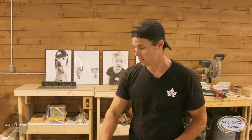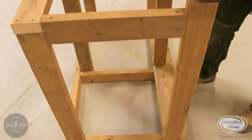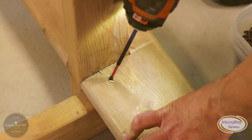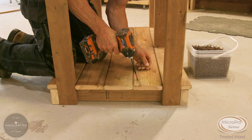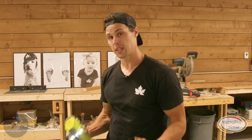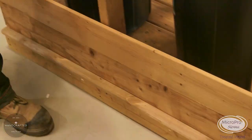It's time to move on to the deck on the bottom. All we're going to do is put down deck boards all the way across, and when we get to the parts with the two-by-fours we'll have to do some notching. I've taken eight-foot fence boards, cut them in half, and I'm simply going to staple them in place. You can add screws if you like for extra security — the staples work really well and make it a lot faster.